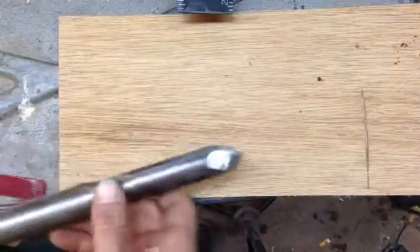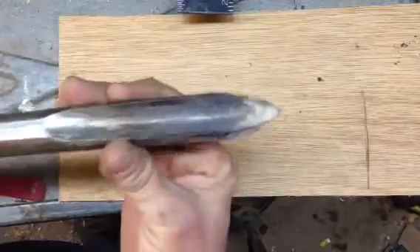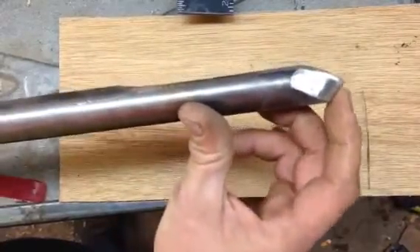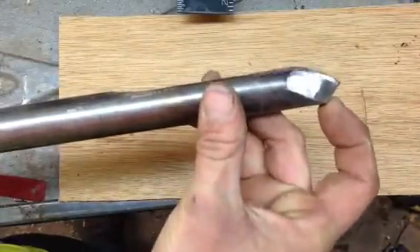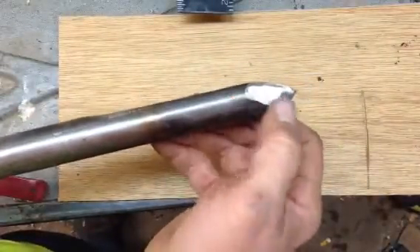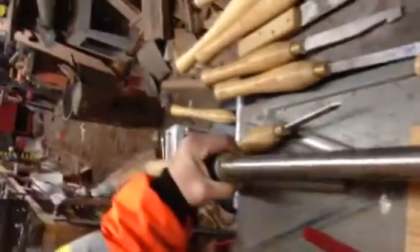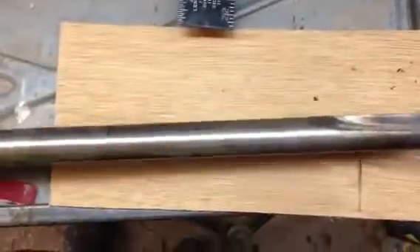In addition to that, when I was talking to you about anti-vibration — this is a 1 inch diameter A2 tool steel, 60 degrees swept back. You can almost see the curve, it's big enough. Just grind it all shaped before you ever harden it, then harden just the tip — no reason to do the whole thing. This entire tool is quite large and quite heavy, but it keeps the vibration down.